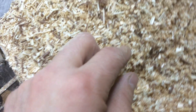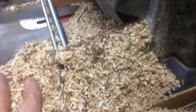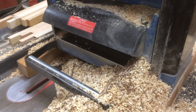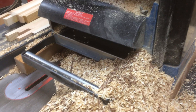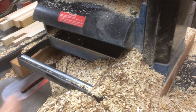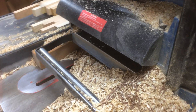What you're really looking for — when you get the little broken, chunky shavings — you can hear a difference in the sound of the planer. A chippy sound means it's going against the grain. You can't always have the grain just right because it changes throughout the board, but when it's rolling it makes a smoother sound.